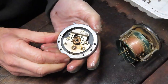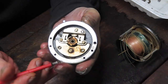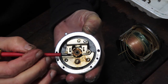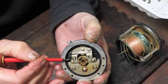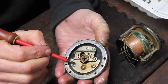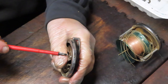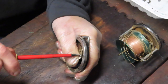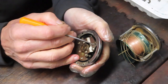Take a picture of this — this is the assembly for the gearing. You can see a difference compared to a Penn reel: we have a yoke, it has a carrier, and a gear inside that carrier, plus yoke springs. The main bridge is only held on by two screws, and the yoke is held on by a little clip. I'm going to take that apart and clean all of this, then put it in the ultrasonic cleaner, which will take about 15–20 minutes.